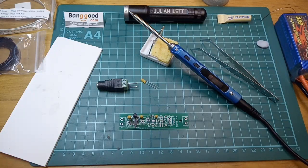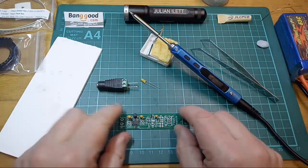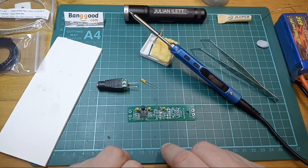What's the chip on that board? This one is a PIC microcontroller. It's the PIC 12F683. It's 8 pins, with 5 IOs, 6 IOs, and all that stuff. Okay. Right, so I think it's time to power this up, don't you? The LED will flash, and then I'm looking for 20 volts.